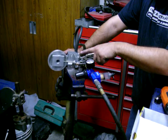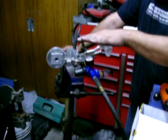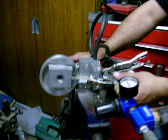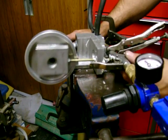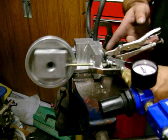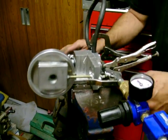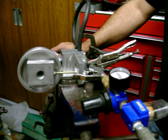The valve guide is actually slotted ever so slightly because there's a slight articulation up and down in that control rod that goes to the valve. The valve is just a regular old Amflow air blower because the valve body isn't made yet. The poppet valve setup just simply wasn't going to work.